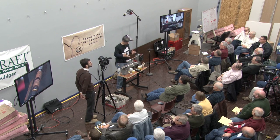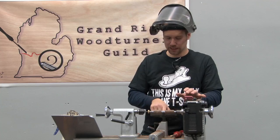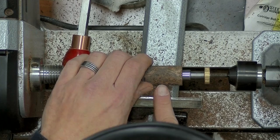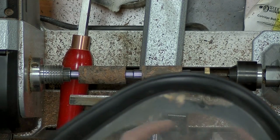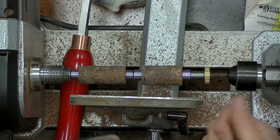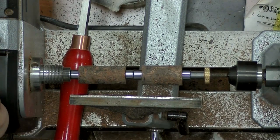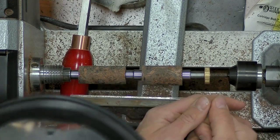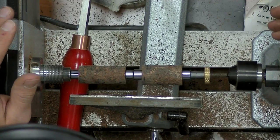So again, I like just the traditional slight arc, so I am going to start with getting it a little more thinner, thin it down just a little bit more, and then I will start to work my way down to the bushings. Now, the way I start out is work from the outside in. What I have run into is when I work in the middle, I sometimes go too deep, and now you're stuck with a very thin, straight, uninteresting pen. So if I work from the outside in on either one of my blanks,